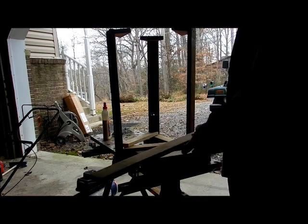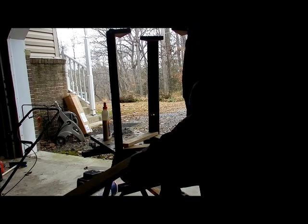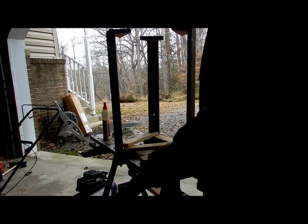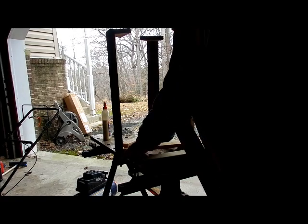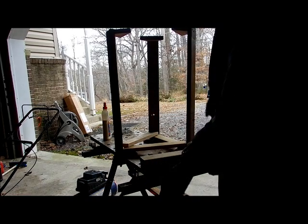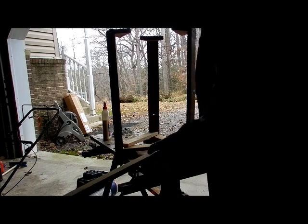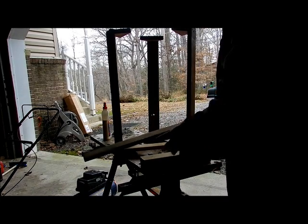Okay, what I did is I missed a spot in the video, so I'm actually backtracking. All right, take your wood and mark it off to the distance that you want, okay? I made a slight error. This is not quite 2 feet tall, because I thought that I would have this piece underneath and this piece on top. So I like to do it this way, so it's okay. And this is about the size that it's going to be, all right? And so cut 6 pieces, 2 feet long on these, all right?